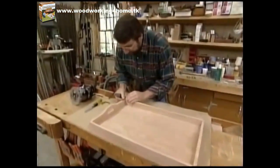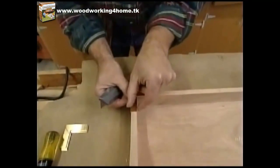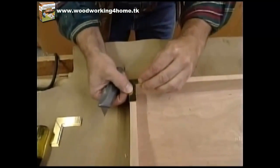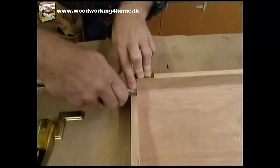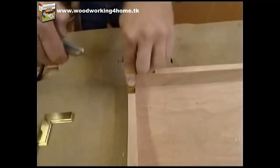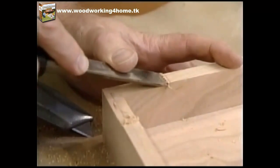Now I'm ready to make the mortises for the bits of brass, starting with the corner pieces. They're a little wider than the wood, so I'll center them by eye, then take a sharp utility knife and score the end points. I'll remove the bulk of the material using my router set up with a half-inch mortising bit, and then clean up the rest with a good sharp chisel.